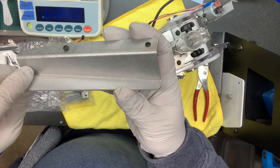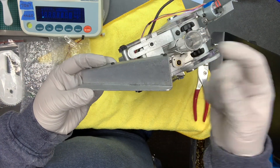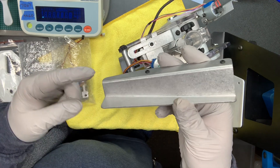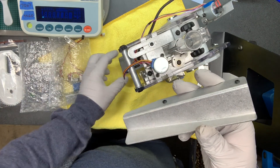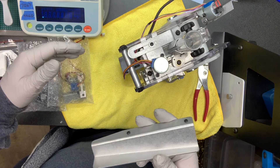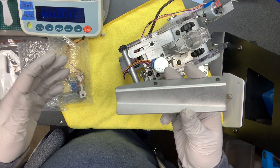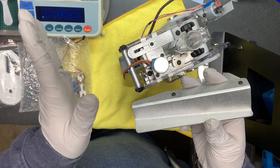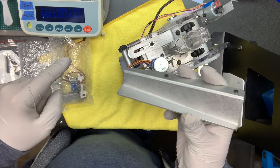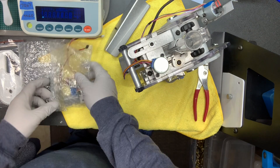This new ramp, instead of being flat, has a tapered side — the fatter end is up towards where it kicks brass out of the shell holder, then it tapers down into your receptacle. I really like this because the old feed ramp was pretty big and brass would occasionally kick left or right. This will direct brass cleanly and hopefully prevent blockages at the top.